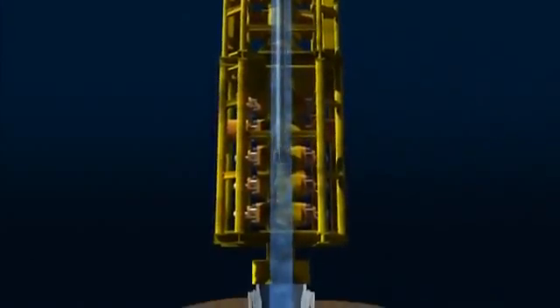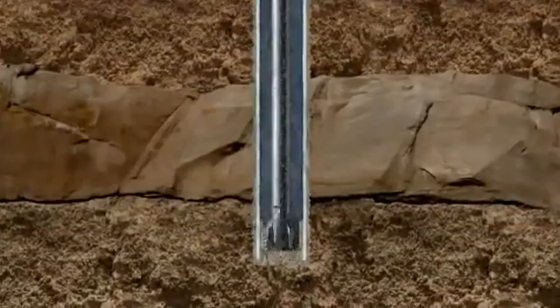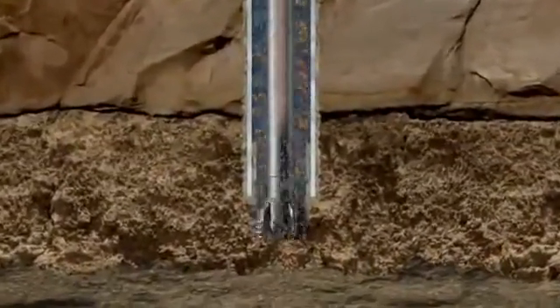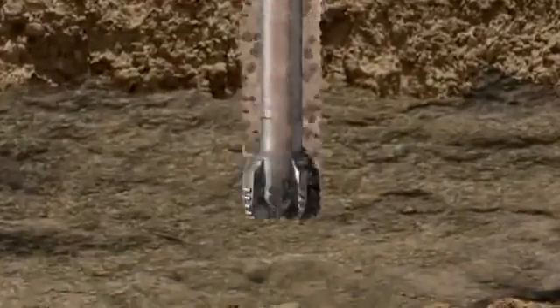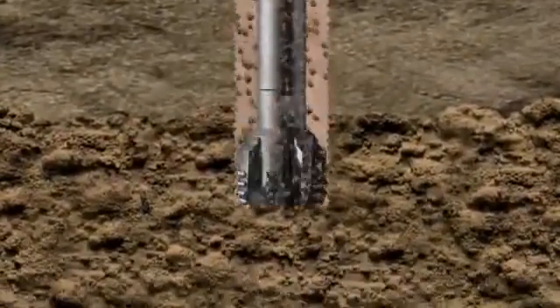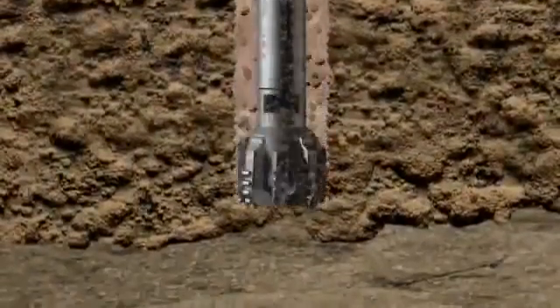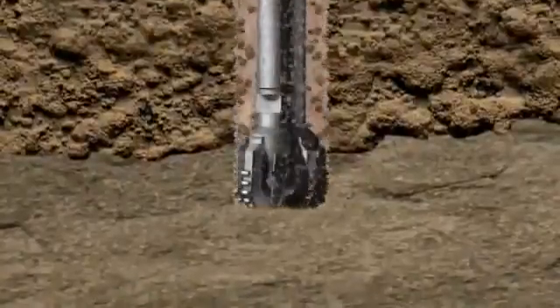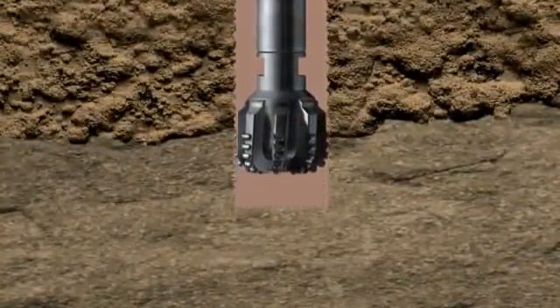From this point onwards, the drilling procedures are similar to those used to drill an onshore well. With a riser in place, seawater is replaced by a special fluid known as drilling mud that is pumped down the string and exits through ports in the bit. The mud not only cools the bit but also clears the cuttings from the hole. The cuttings are captured at surface and examined by geologists to characterize the rock types that are being penetrated.